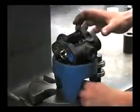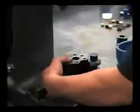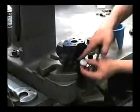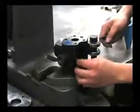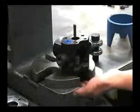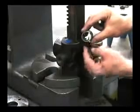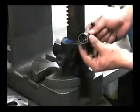Next, we can push out the sleeves. You'll want to have something that will fit on top of that sleeve but also be able to slip through that bore in the body. There is a special tool for that listed in the owner's manual if needed. Press that out and inspect the inside of this sleeve for any scratches deep enough to fill with your fingernail, or any pitting.